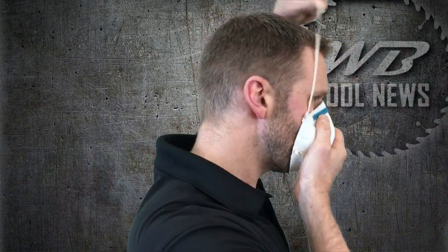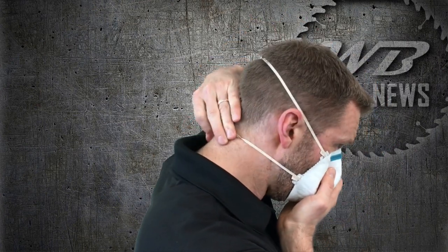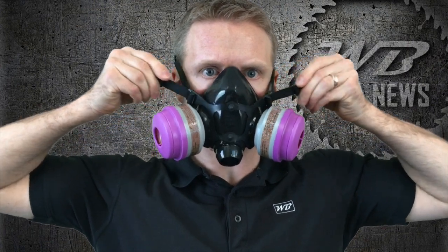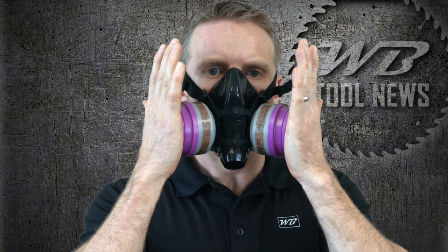In order for your respirator to be effective, it is paramount that you wear it correctly. For a molded disposable respirator, start by holding the mask in position over your mouth and nose. Position the top strap high on the back of your head, then pull the bottom strap out and over your head, positioning it around your neck below your ears. Using both hands, mold the nose piece into shape, creating an even seal. Perform a fit check by placing both hands over the mask and breathing out sharply. For a reusable half-mask respirator, place the harness over your head and close the clasp behind your neck. Adjust the straps to create a snug fit, then perform a fit check by covering the open areas of each filter and breathing in gently for 5-10 seconds to ensure no air is escaping.